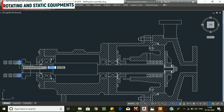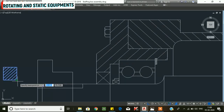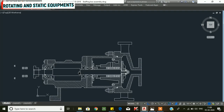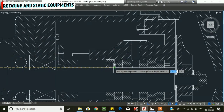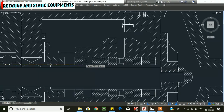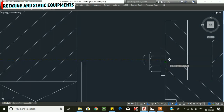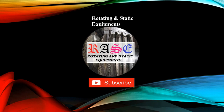When installing, loop the gland packings and cut the sections at different clock positions as described. Change both the internal and external packings. Then insert the gland follower and install the gland follower lock nut. In this way, the external packings can be easily changed. Thanks for watching this video.